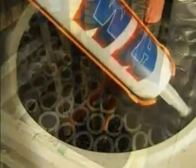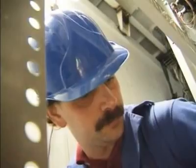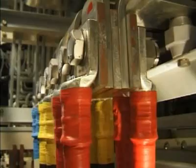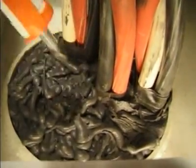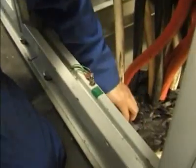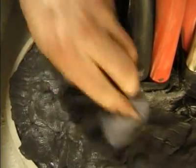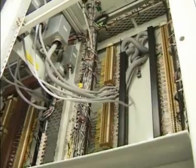The top side of the penetration is sealed in exactly the same way. FIWR sealant is applied over the sleeves. The cloth, dampened with water, is used to push the sealant down and to ensure that the sealant is between all the cables. Finally, the sealant is smoothed by hand, and the job is finished, leaving a very neatly sealed penetration.